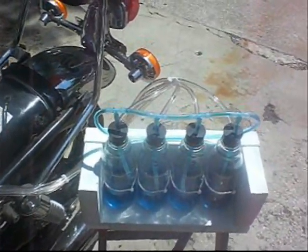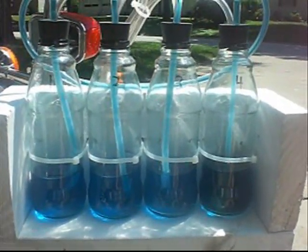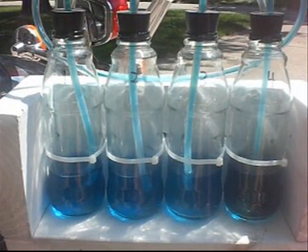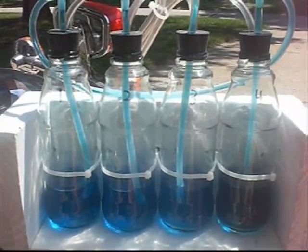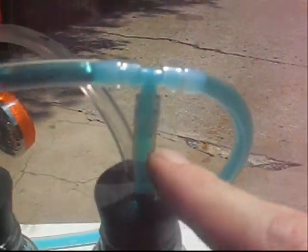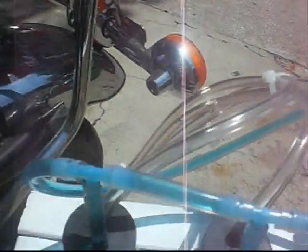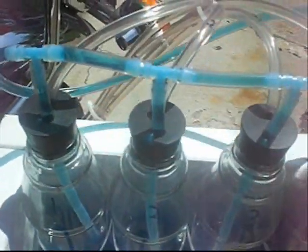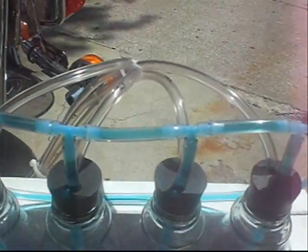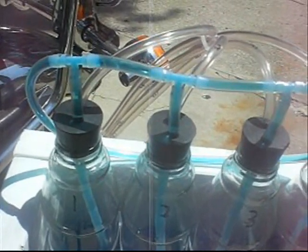Here is my manometer - you can see four bottles of water with tubes tied together. The core of this design is that you don't care what the actual levels in the bottles are. You're not measuring inches of mercury or water or anything; you're measuring relative pressure to the other bottles. This is accomplished by these tubes which flow down into the liquid, all interconnected within one loop. This creates a reservoir where all the bottles' fluid is interconnected. You don't want any air in these lines to maintain maximum sensitivity.